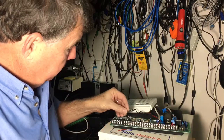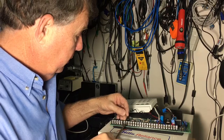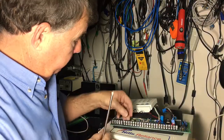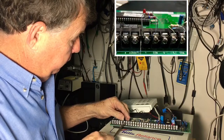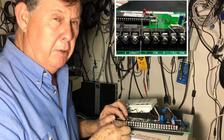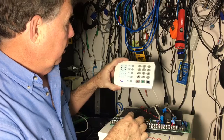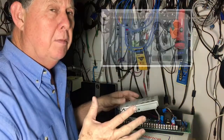What I'm going to do now is put into zone 1 one of the 3.74K resistors and also the 6.98K resistor. You can see these are actually going in parallel — both zones are wired into the same set of terminals. Zone 1 doubles up as zone 1 and zone 9 when using zone doubling. With that in there, zone 1 is sealed and zone 9 is sealed too. So zones 1 and 9 are working off these two resistors. It's quite a simple system.